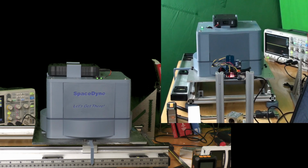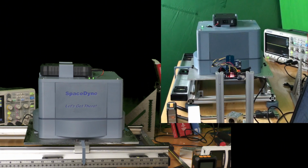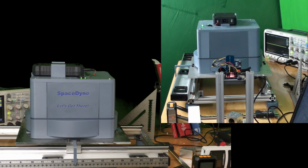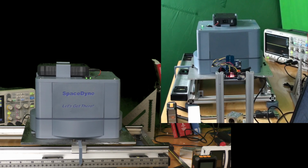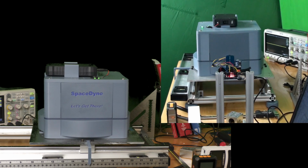Third, I've worked out the math and the physics that you are seeing, and the results are within the expected experimental error. I'm using an Arduino R4 Wi-Fi coupled with a time-of-flight sonic sensor and a micro SD card to store the data to determine the distance to the ImpulseDrive as it moves towards and away from the sensor.